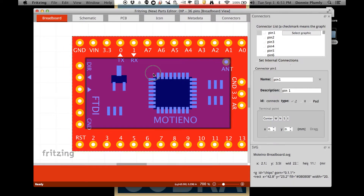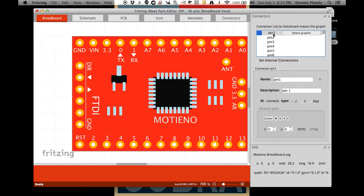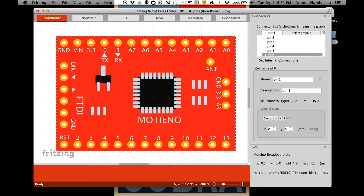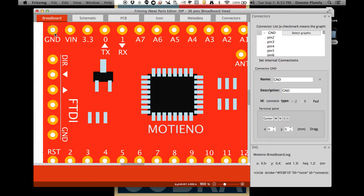Now in the breadboard view, you can see where it says pin one — we need to label all these pins. I'll label them starting from ground going right, then down, then left, then up. Click a pin: for pin name put exactly what's written there, such as 'ground', and same for description. Then select a graphic for it — click it twice to get the little finger cursor, not the other cursor, or it won't work. When you click on the pad you'll see crosshairs, which means it's assigned. For the next one, type 'VIN', select that graphic, get the little hand, and you're good.